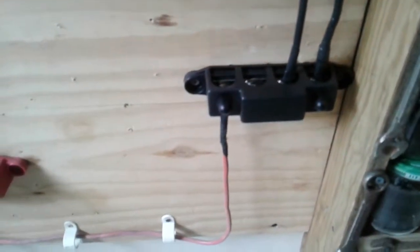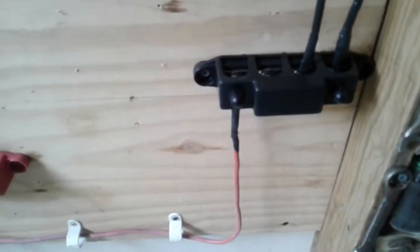This is where my PV negatives are combined. The negative for the battery goes into a bus bar — same here, comes down into a bus bar — and then one cable comes out and goes to my negative bus bar, and then off to the battery.